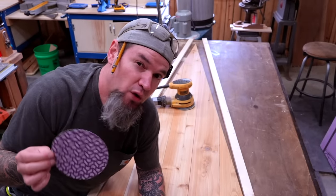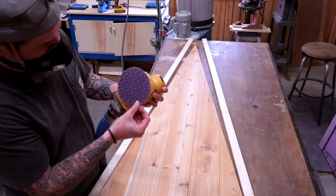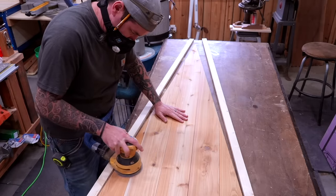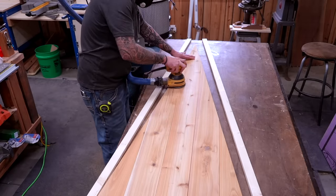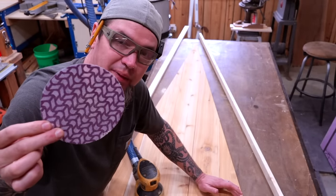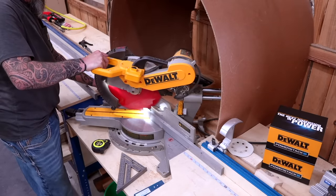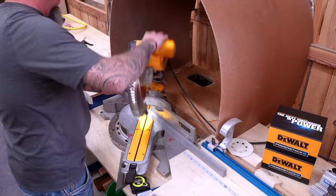It's 3M's Cubitron 2 Extract 710W. The only reason I haven't talked about this disc before is because you could only find it in bulk — who needs a hundred of each grit? But now I've found a place that sells these in smaller variety packs. I like this disc because it lasts longer and cuts faster — this design keeps the disc cool while the ceramic precision shaped grain does its thing. I'll throw a link in the description. So we're going to start by cutting our two pieces of side trim: two boards that are 74 inches long with a 45 degree cut on one end. You can pre-stain the material but you'll have to make a couple of touch-ups.